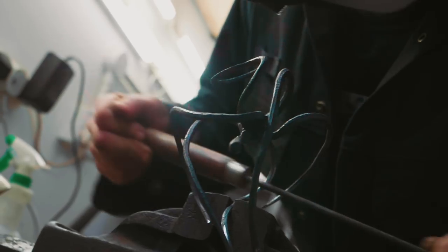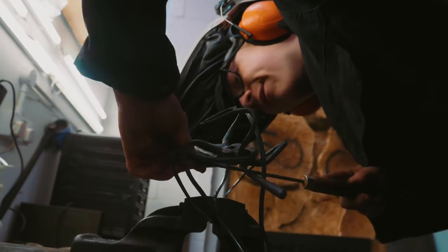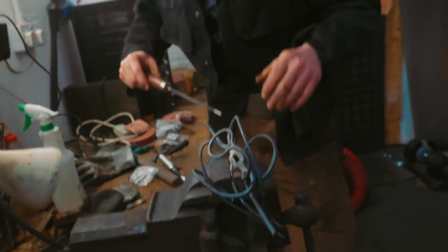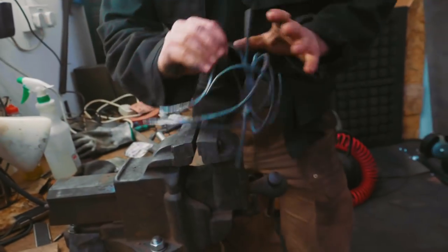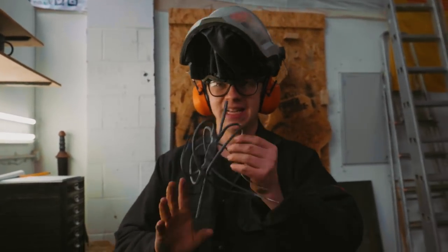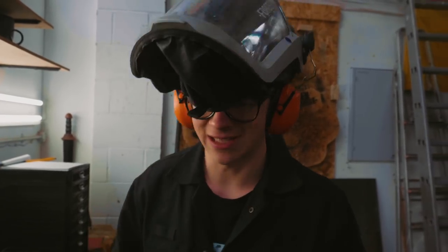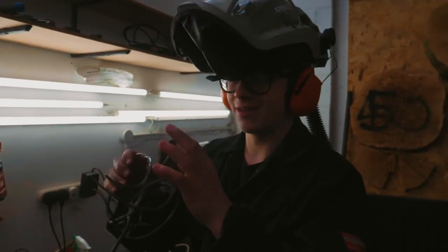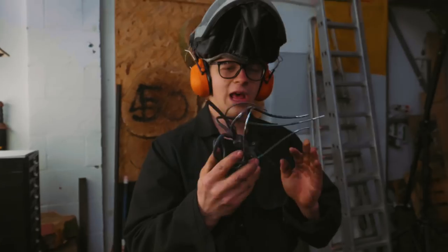The whole premise of what I'm doing here is cleaning everywhere where we're going to be welding — all around the diameter of the piece. I'm not very good at TIG welding, and TIG welding dirty metal is difficult. Not only am I going to struggle with control of it anyway, but if there's any dirt and impurities in there I'm really going to struggle. I've been using one of these little tools with abrasive rolls, as well as a file, to just clean everything up. When we go to weld it, it's all clean and neat — TIG welding wants cleanliness.